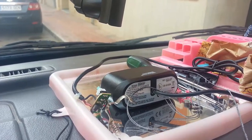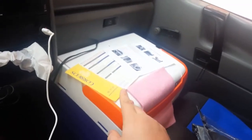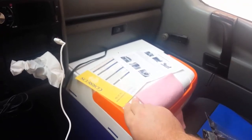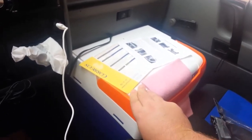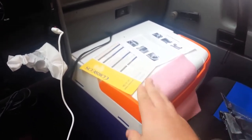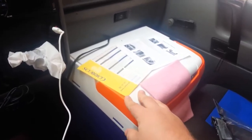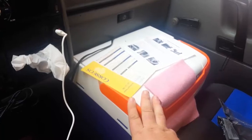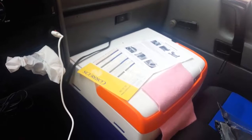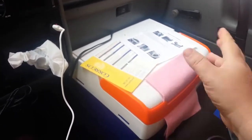Because obviously when I start thinking about solar panels, I've got to start thinking: what am I going to run on it? Cool box, laptop, TV. I need to know the combined usages of those units to work out how big a solar panel I need. Also, do I want a solar panel just for now and again, or being able to actually run all three and gather more energy for during the night when there's no power available through the solar system? So you've got to sit and weigh all this up for the long term.